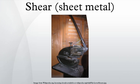The small shear is mostly designed for a wide field of applications. Lightweight and easy, efficient operation, yet very sturdy in construction. The cutting blades fitted are carefully and accurately ground to give easy, clean, quick cuts, free of burrs. These special features help the operators save a great deal of their energy. Some shearing machines can cut sheet bar and flat bar up to 10 mm.